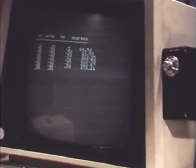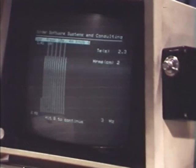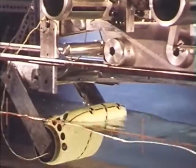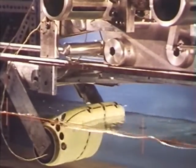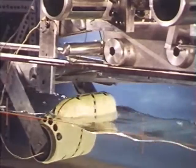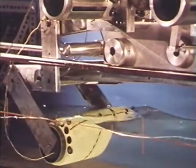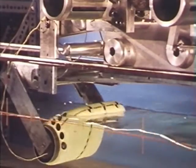This is the computer that's making a spectrum for driving the narrow tank wave maker. And this is the result — quite a rough sea, probably a Pierson-Moskowitz spectrum with one second period but rather increased amplitude. You can see the mounting moving quite a lot now. It's designed to yield if the force exceeds what we think is the economic limit, and then it goes to a constant restoring force.